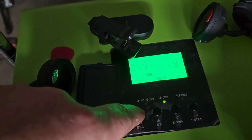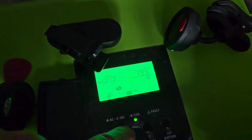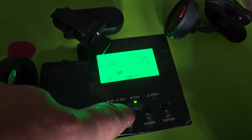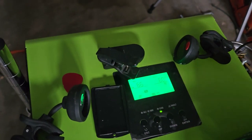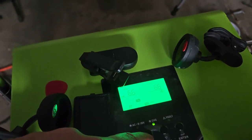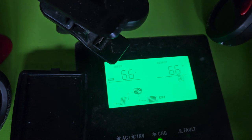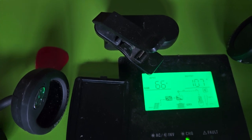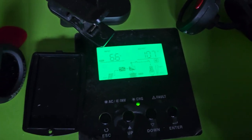Right now, let's see, we're not even on right now, but we've had solar storms. I keep thinking of ham radio, solar storms. We keep having thunderstorms. So right now I'm 66 volts coming in here, and I'm putting out 60 watts. I'll flip it on, and it'll take a minute, but the air conditioner will put like a 500 or 600 watt load on it, and then there's a second air conditioner that I run sometimes on it that's 1,000 watts. So, at any rate, I've never seen it go over like 2.1 kW on the input side.